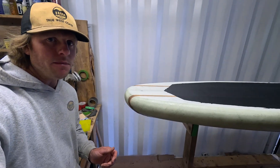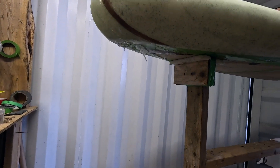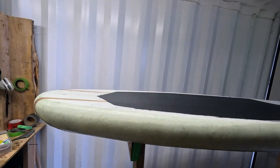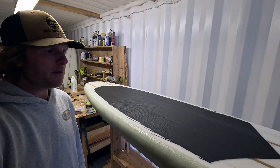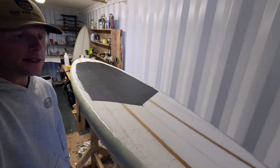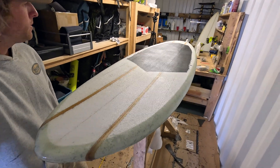That's the top lamination done. All went pretty well — it's nicely saturated out, similar to what we did with the bottom. We'll have to come back in about five hours and cut the cut lap. We'll give it about four or five hours at this temperature, and I'll be checking to see when the cut lap's ready.